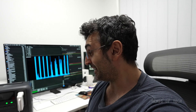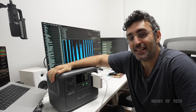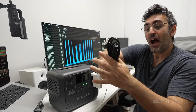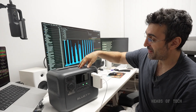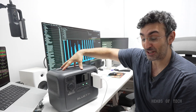It can shoot up to 1000 watts, so you could have maybe eight of these Macs plugged in doing LLM AI work — battery-powered AI is coming! The good thing about this system is that it can also work as a UPS and it delivers pure sine wave output, so it's very friendly for computers and sensitive electronics. We're now going to test the UPS functionality — it has a 20-millisecond switchover time. We'll plug it into wall power so it charges the battery while also passing output through to the Mac.